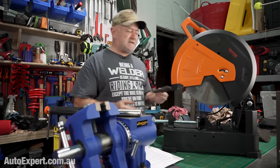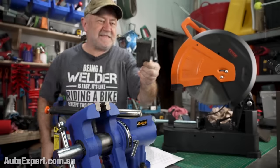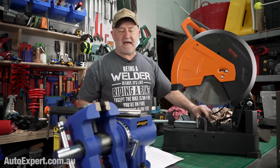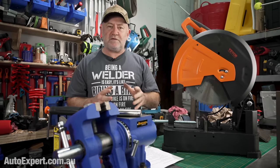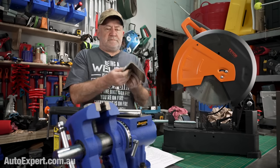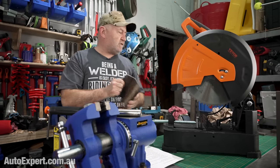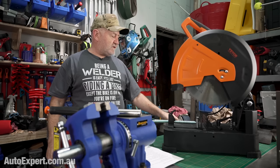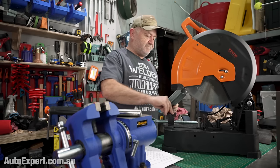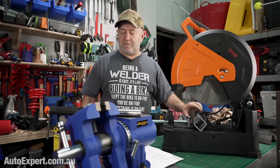For example, if you've got a piece of flat bar to cut — say 50 by 12 — instead of cutting it flat, put it on its end in the vice. You'll get the fewest number of teeth engaged, which gives you better blade life. Likewise, if you're cutting a piece of angle, put it flat down on the table and clamp the vice on each side — that gives the best result from a tooth engagement point of view. If you've got a V-block and you're doing a straight cut, you can mount square tube on the diagonal — that also gives you better blade life. A V-block is kind of non-negotiable for this kind of cutting.